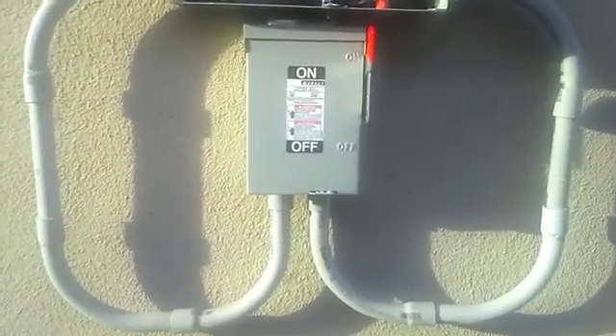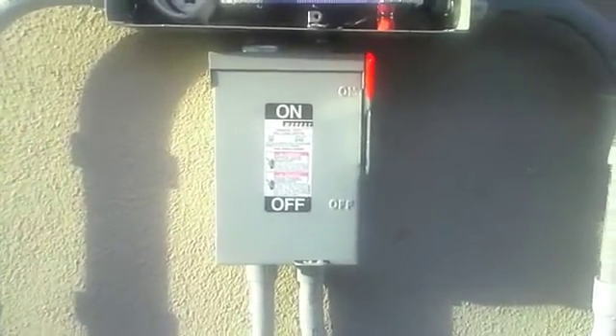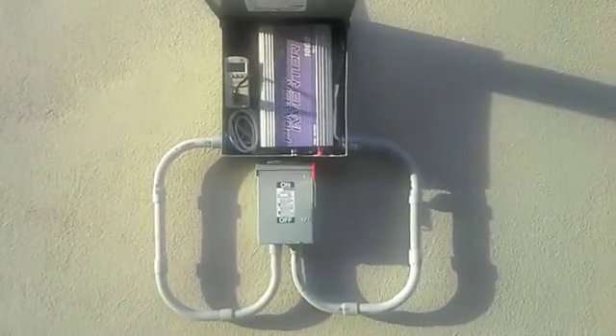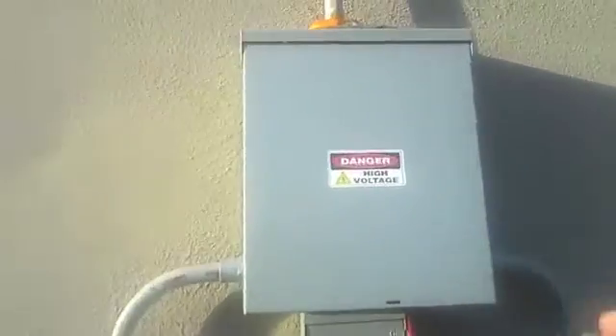Here's my system. This is the shutoff switch, which is rated at 50 amps — the total system is running about 35 amps right now. The DC from the panels can be shut off here, and I used 8-gauge wire throughout. 8-gauge is rated to 40 amps. This is the main box which holds the 1,000-watt grid-tie inverter and also holds the return back to the house grid. I pig-tailed it from the outlet in the kitchen — it's a tight fit but I think it's going to be okay.